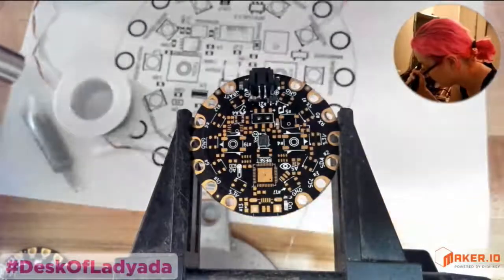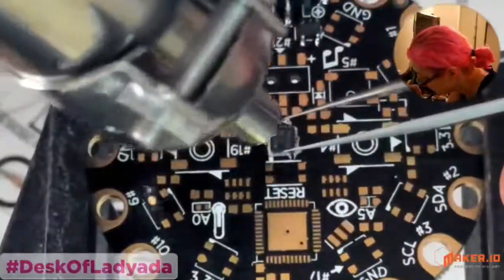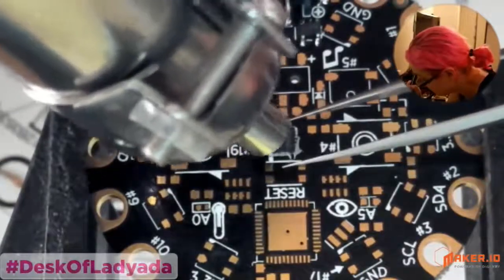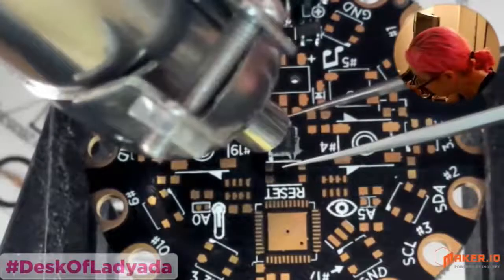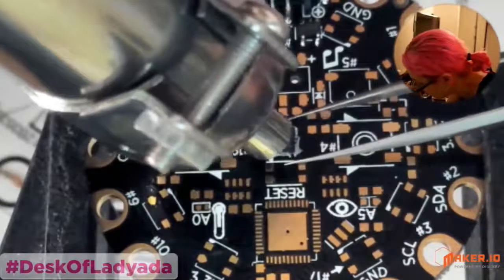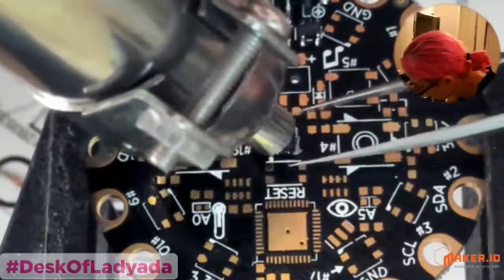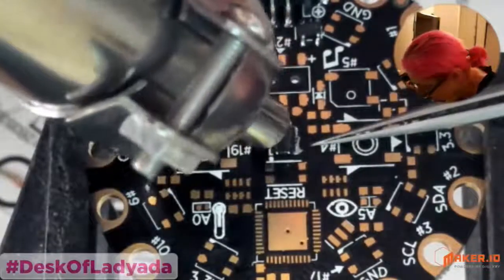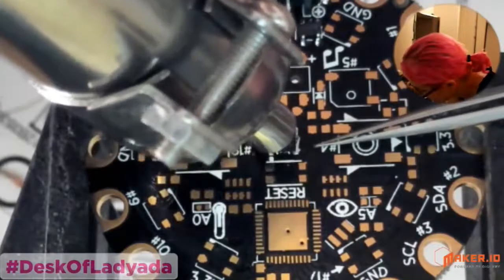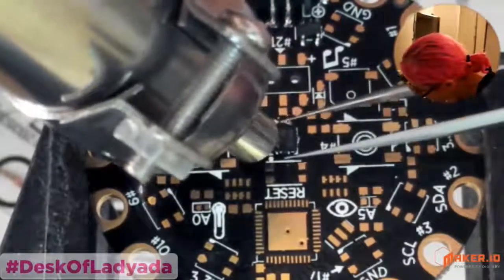Another thing you have to watch out for is the air will blow your part around. So you want to heat it up, but not from the top only, so it doesn't get pushed around and shoved out of the way. And as you heat it, you'll see the paste go gray, and then in a split second, turn liquid. Oh, neat. Can you see the liquid? Okay, this is about to turn. Yeah, the side near reset turned, and then you have to really heat it up, but there you go. There it goes! It's liquidy, and then...